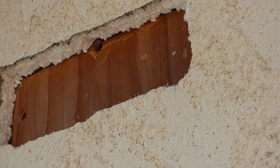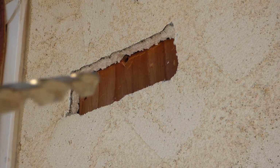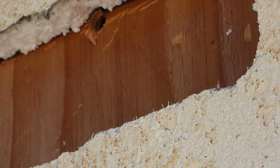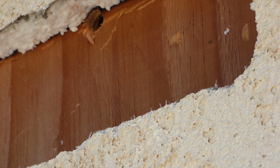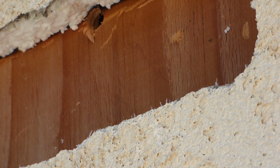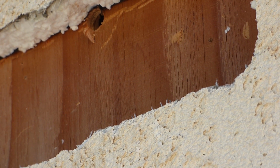And you can see there that we got some holes drawn, thanks to a half-inch drill bit here. And what we'll do then is, with those holes, we can start the reciprocating saw, and we change blades from the stucco one, or abrasive one I should say, to a rough wood cutting one. That's what should make short work of that inner wall panel.